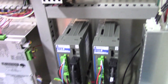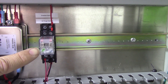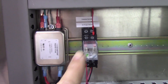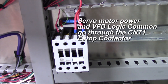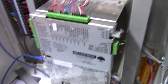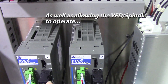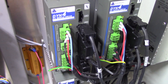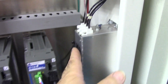This is the draw bar / spindle air purge interlock. When the spindle runs, this relay energizes and turns on the pneumatic solenoid for the air curtain, sending air around the spindle to keep it clear. When the spindle is off, it returns to its normal state and allows use of the draw bar button on the side of the head. This is the e-stop relay — it's controlled by the Oak and by the e-stop button. When the Centroid software is in its ready state, that contactor is energized and provides power to the motors of the Dyn4 servo drives on R and S. L1 and L2 is logic power coming from the EMI filter fed from those two fuses.